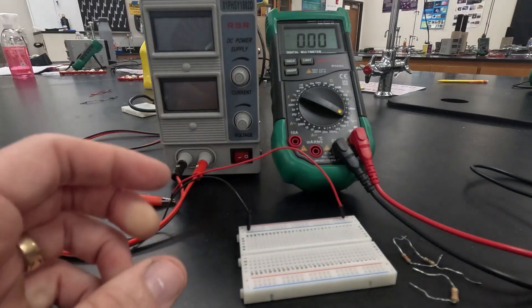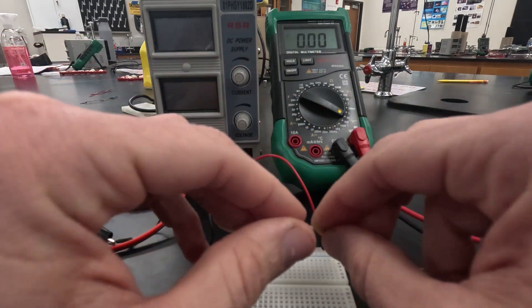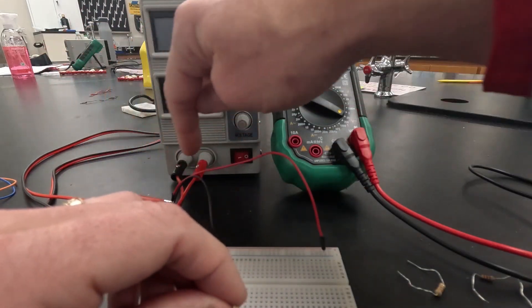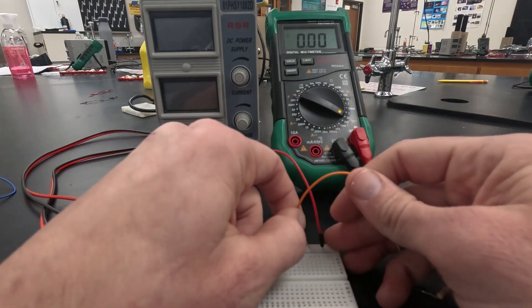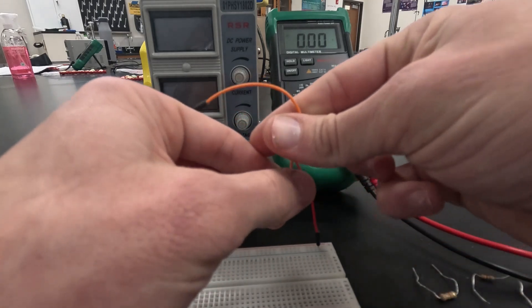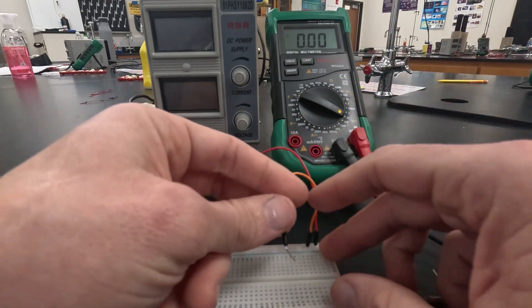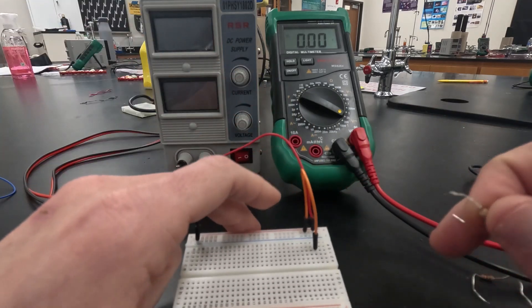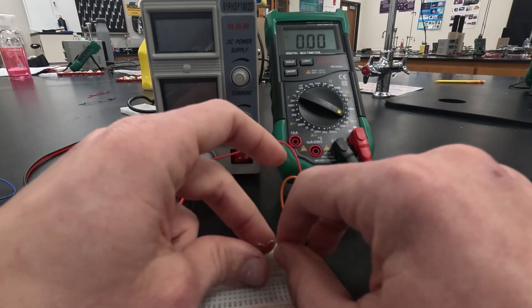Those are the three resistors we're going to use. It tells us to place them in series, so we're going to place them in series on our breadboard in the same order I talked about them. I'll start with my 100 ohm resistor. My electricity for conventional flow comes from the positive into the red wire, then I'll take an orange jumper wire. In your breadboard, everything on each end connects vertically. I'll take my wire and stick it into the positive side, then I'm going to begin my circuit at row 3. I'll put the first leg of my 100 ohm resistor into that row, in line with that orange wire.